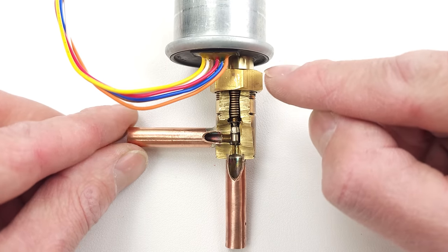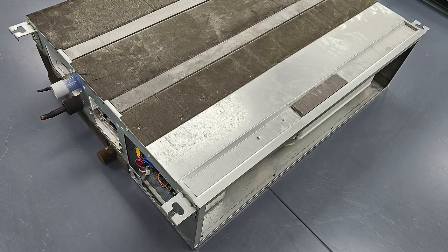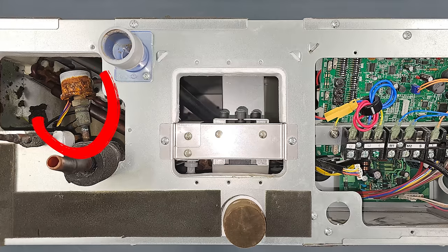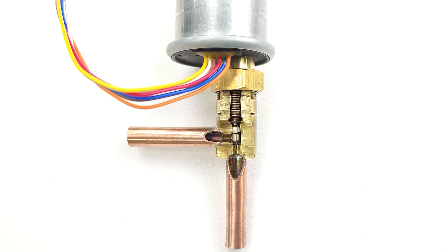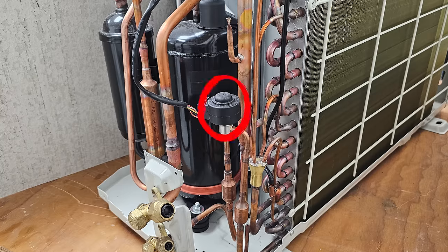This version of the LEV or EEV is commonly found in VRF indoor units and mini VRF indoor units. This here is a slim duct unit out of a VRF system — a variable refrigerant flow system. With these style systems you have an EEV or LEV at the indoor unit. That differs from a mini split indoor unit because there is no metering device at that unit; it's only in the outdoor unit.